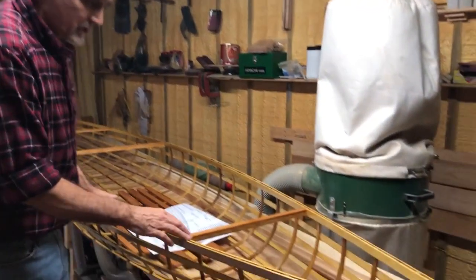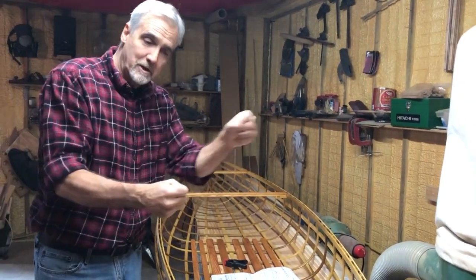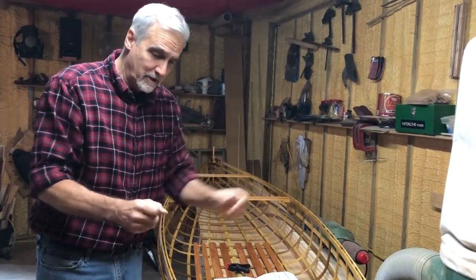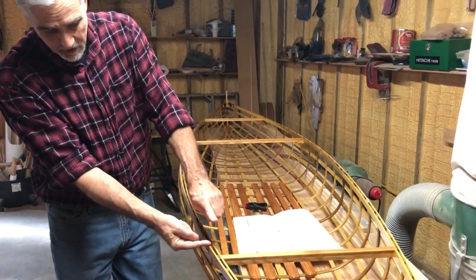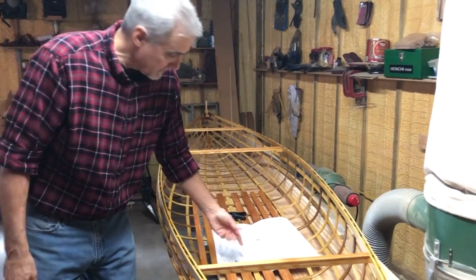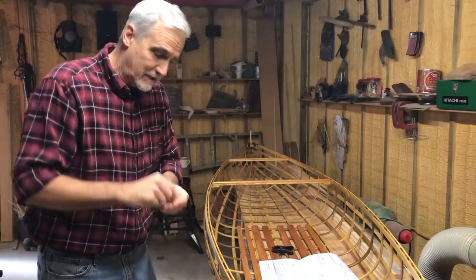The way you do it: a boat would be upside down on the forms, and the ribs would be over length because you've bent them and put them in there. So what you do is just cut off the ribs — don't cut it off flush, cut it off a couple inches above there. Cut it off and then take it — I used a little bandsaw on that — and just cut off a bunch of little pieces like that.